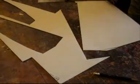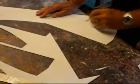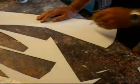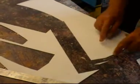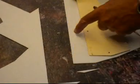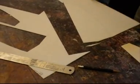You can see it's relatively easy to cut out. One of the things you've got to watch is when you're making a curve, it'll tend to push you away, because we've orientated this so that the line on here follows the horizontal flutes, and this gives a stronger side when you've bent it.